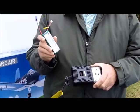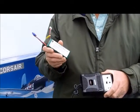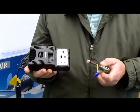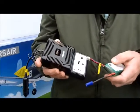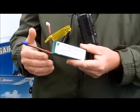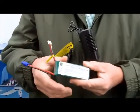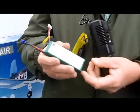Okay, word on the batteries. These batteries are very nice for flying. We get a lot of use out of them in the hobby, but we have to respect these batteries because they are very volatile. The charger that comes for your automobile is very nice, but do not plug this battery on charge and leave it, because you want to monitor this battery closely when you're charging it. This battery is, all in all, pretty good and safe, but if you've damaged the battery, if you puncture it, it could erupt into a fire, and one of the areas that could be a fire hazard is during the charging process of it. So monitor them. If they swell up or if you puncture them, discard them and keep a good battery.